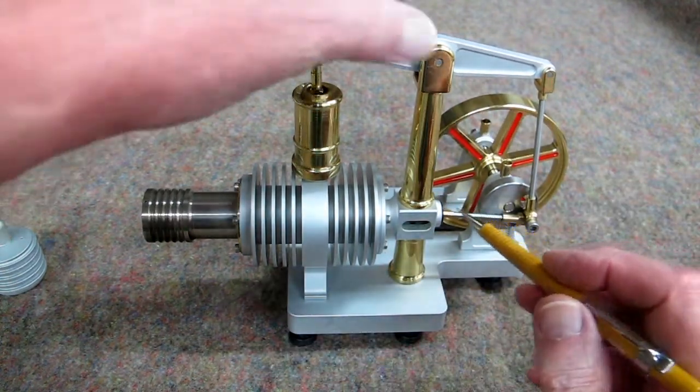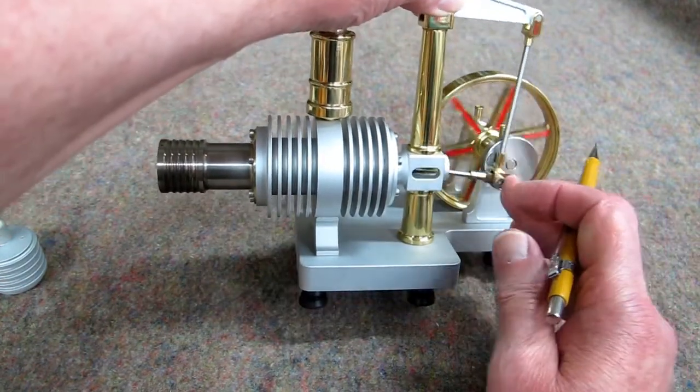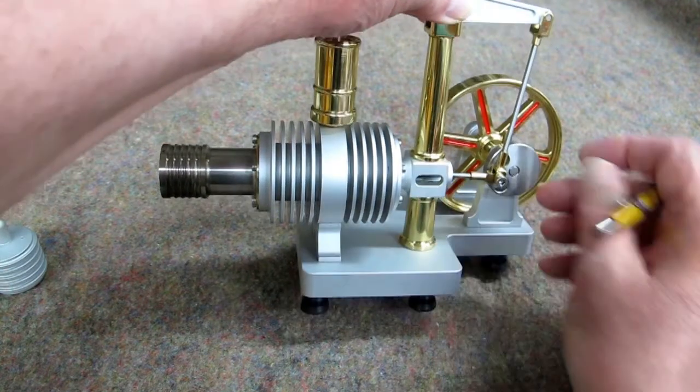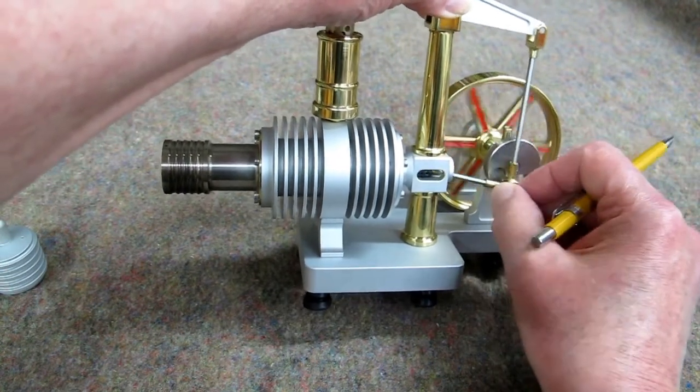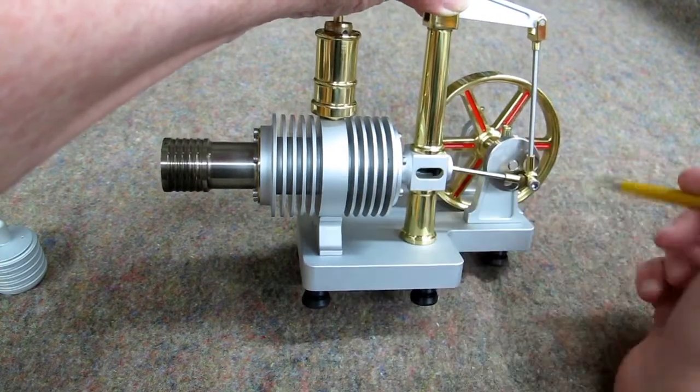I stand this on end and put just a little bit of oil on this pin joint inside the crosshead. Very occasionally, you want to put just a little grease. Bring this all the way back and put a little grease on the crosshead guides. Work it back and forth so any excess is drawn out and not carried into the engine.